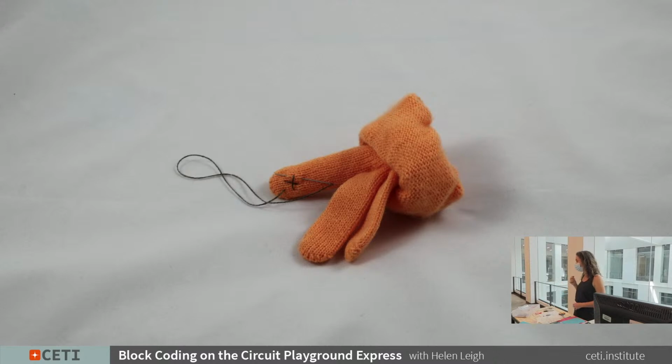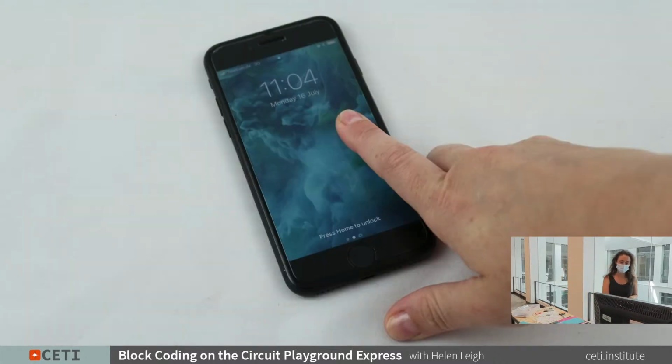To make any ordinary glove into a touchscreen glove, all you have to do is take the thread that you have used today, and you don't have to sew any components onto it or anything. All you're doing is sewing a pad through the fingertip of your glove with that thread, so a little pressure pad essentially, and that will transfer the capacitive touch from your fingers through the glove, no matter what material it is, into the phone. So you can hack any glove into a touchscreen glove just by using a few little stitches in the finger of your glove. I did want to show you that.